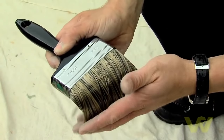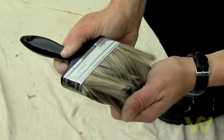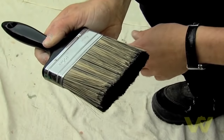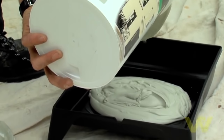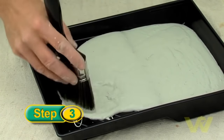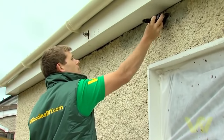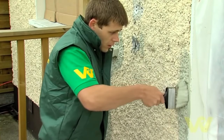You can use a brush or roller when painting pebbled dash masonry. Make sure the brush you are using is a proper masonry brush, which will hold more paint and allow you to get into all the areas. Using a masonry brush, cut in around all the edges first — for example, gutters, windows and door frames.